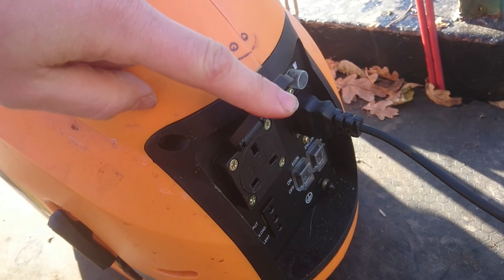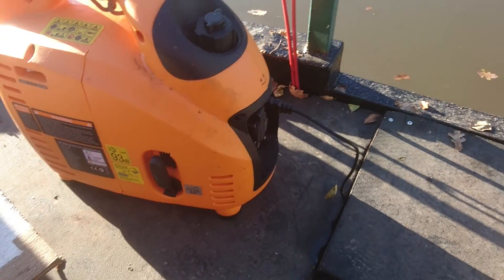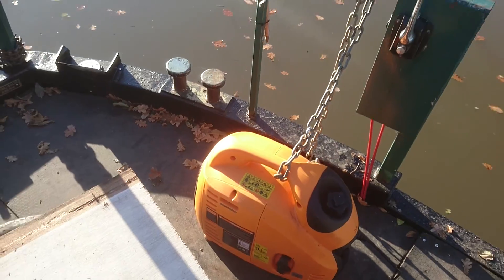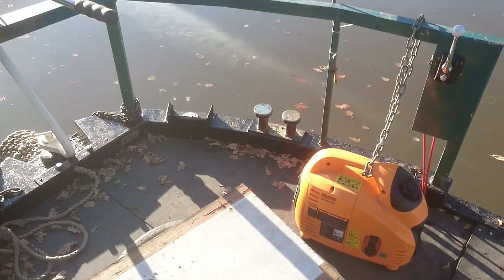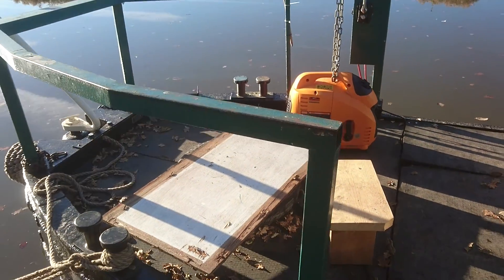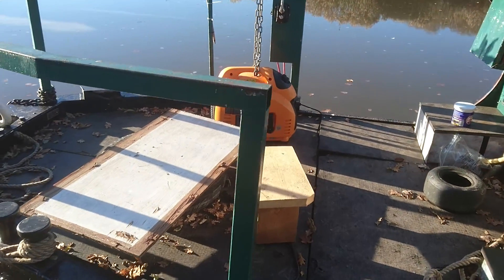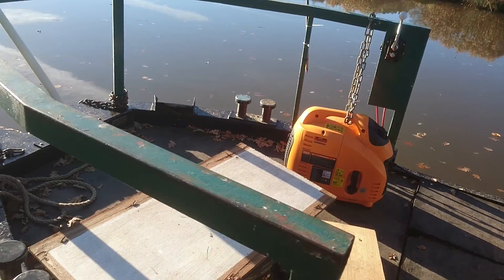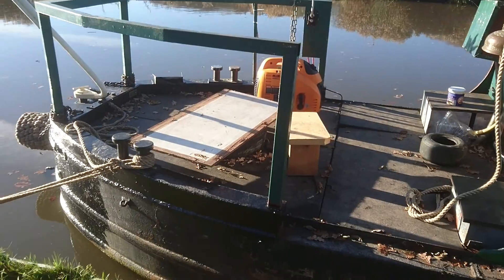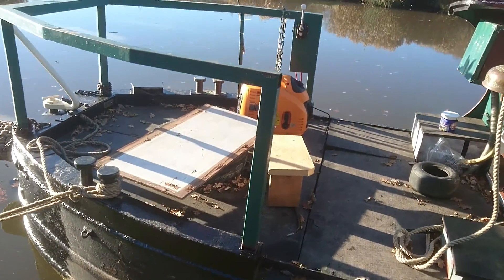And then just here you can see it's got a normal plug socket, so you plug your normal socket in, it goes through the boat and gives you mains power inside. And it's a sine wave generator — that's really important to remember. If it doesn't generate a pure sine wave, your fine electricals will go cuckoo. If you've got anything with a touch screen on it, it won't work properly. Like your laptop touchpads — they go really bizarre. All kinds of terrible things happen to your electronics, and I wonder about how much it damages them long term. So you really have to be careful of that. But that's a good generator — that's about £280. Once you've got that and the panels, you're done for electricity for life. You never have to pay another electricity bill — just a little bit of petrol for the generator.